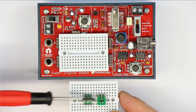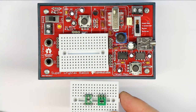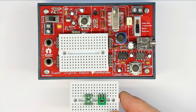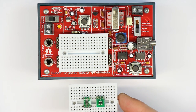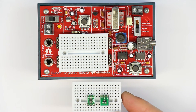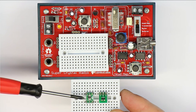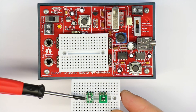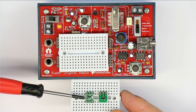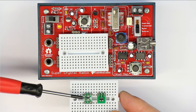These microwave Schottky diodes are between 10 and 100 times better when it comes to the reverse current compared to the best amateur Schottky diode, for example, a BAT43. They have extremely high dynamic impedance, and they are between 10 and 100 times better when you use them with a high Q AM antenna.